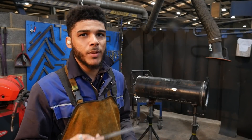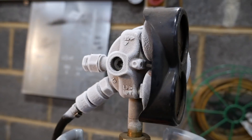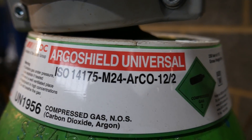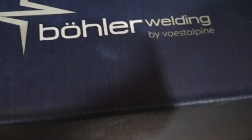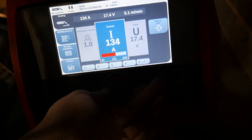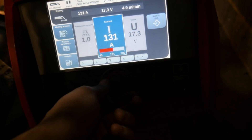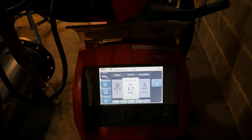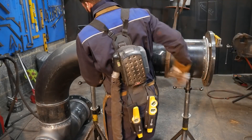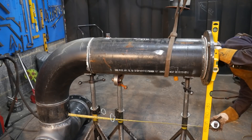This isn't a tutorial — I'm just showing you something a little different. I don't always do positional welds on here, so I thought I'd bring you along for the journey on my final welds with this pipe. I've been running the gas quite a bit in this cold. For the wire I'm using 1mm solid core copper-free, and for the root I'm going to be using the Fronius synergic setting, where I control the amps and Fronius takes care of the wire speed and voltage. I'll be around 130 amps.